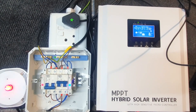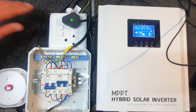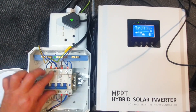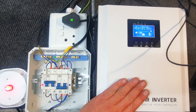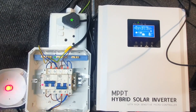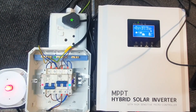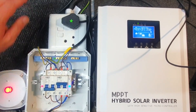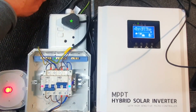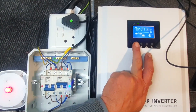The transfer time is quite fast. For instance, if the inverter goes off or is faulty, you simply go to your board, switch on the load from the mains side, and everything is fine — you can take the inverter for repairs. Or if your batteries are flat, you can switch over easily. When you bring the inverter back, you can just switch it back on. The indication light also lets you see whether power is present before working on the system.